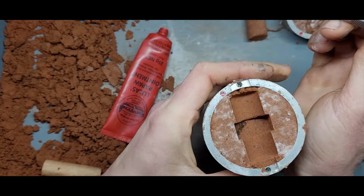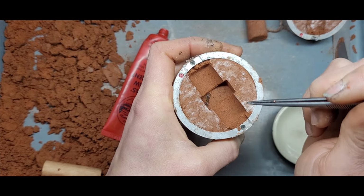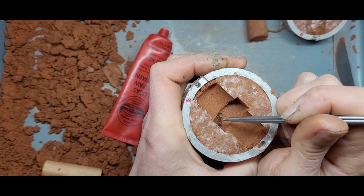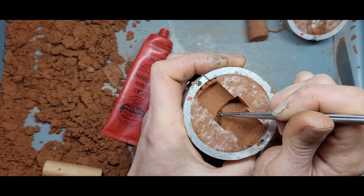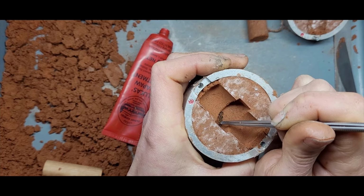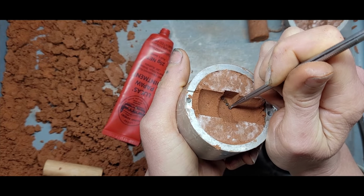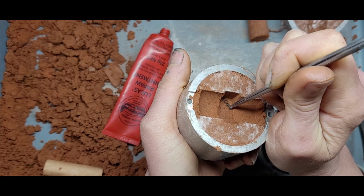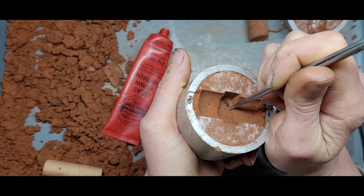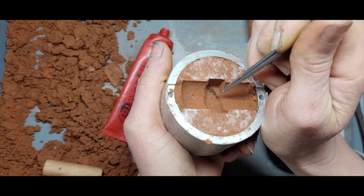Could I fit one more stone in there? One of the things I have to be mindful of is, as this metal cools, it shrinks. And that means if the stones are already touching and then the metal starts shrinking, it's going to make those stones want to come even closer together. And if they're already touching, they have nowhere to go but into each other, and then we'll get some broken stones. So, got to make sure there's a tiny little gap between them.